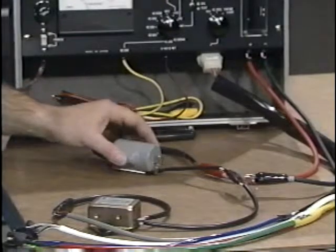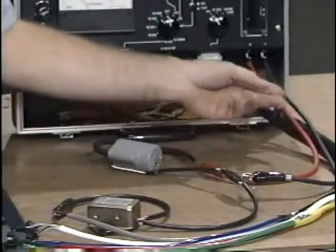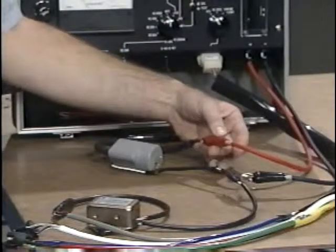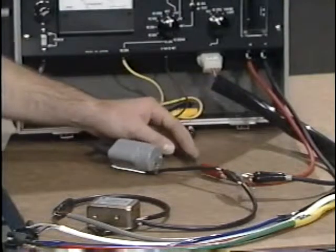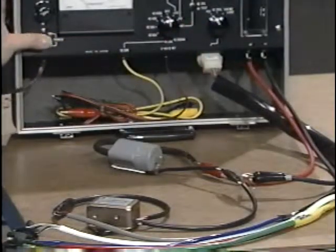Because of the complexity of the PEI unit, there is an optional test that allows you to check both the ignition coil and the PEI unit under actual operating conditions. Leave the PEI test leads attached to the PEI unit, install an ignition coil to the PEI unit, and install a small clip into the ground wire. Install the high-tension test lead to the clip and to the high-tension wire of the ignition coil. Rotate the selector knob to the PEI position, turn on the tester, and observe the spark in the window. This test should run for a minimum of five minutes.